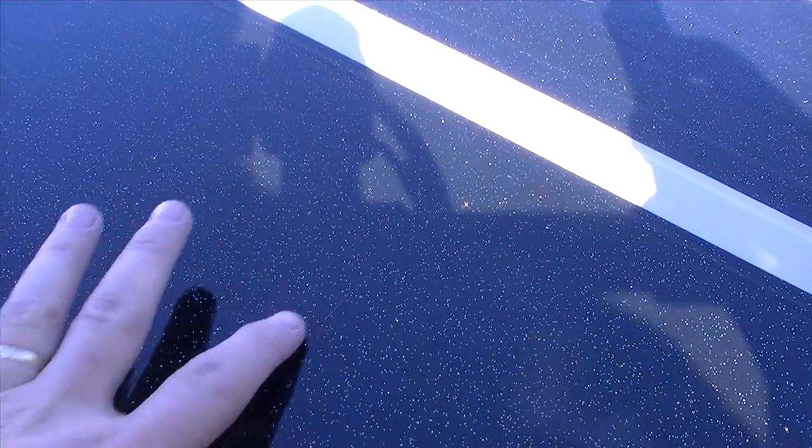We got a couple of gel coat cracks, which you look right there, you can see it. There's a little crack right there. I've got 2 of those up here, and I think we may just take a little bit of clear and brush it in there and then level it out. I'm not sure that we're going to actually do that yet, but it's something we can do. It's really not tremendously noticeable, and the reason you can see it now is it's got polish in it. We can run some mineral spirits, clean that polish out of there. That way it won't stick out.